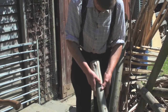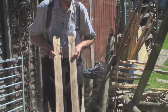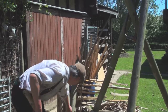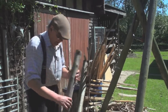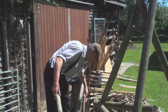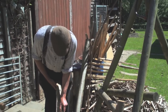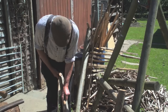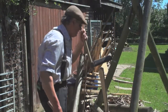That is what we call the splitting image. That needs to be split again. I could try to be clever and get three handles out of that, but that's asking rather a lot — you'd have to be spot on with the cleaving, and if it ran out anywhere you'd finish up with nothing much. So I'm just going to play safe and split that in half, starting it off down the middle.